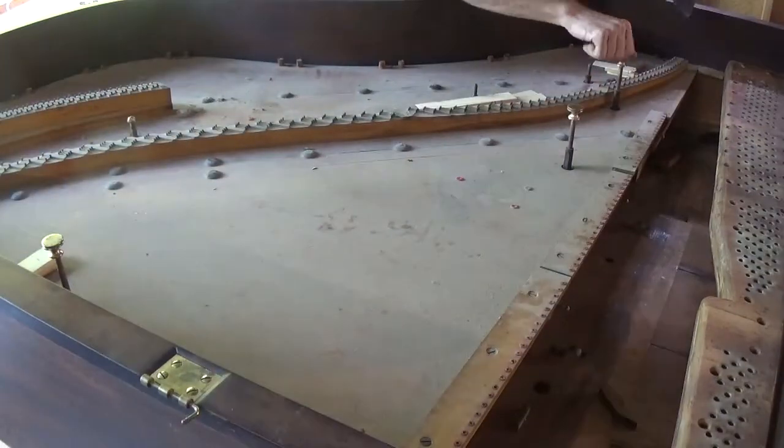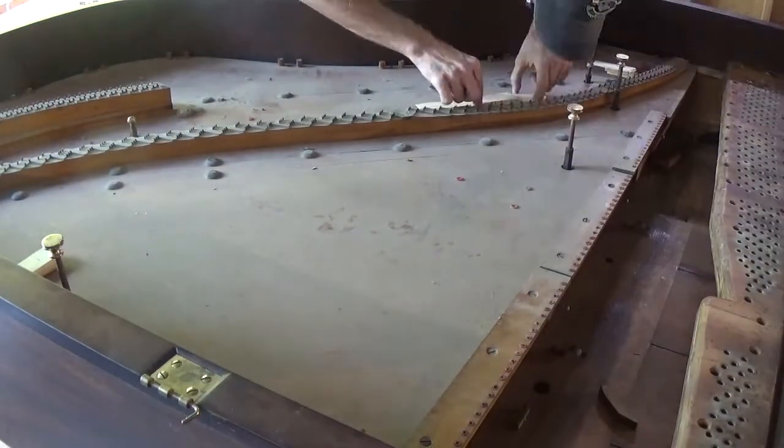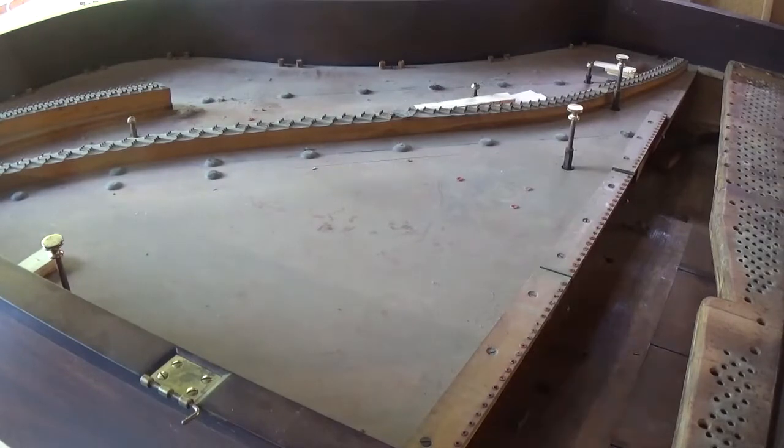After the plate has been removed, I put the nose bolt nuts back on their bolts so I don't lose track of them. Then I return back to the wedges so I can record where they were placed and tape them together so I don't lose my measurements.